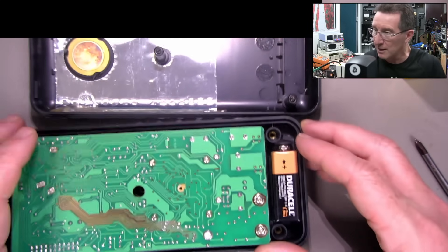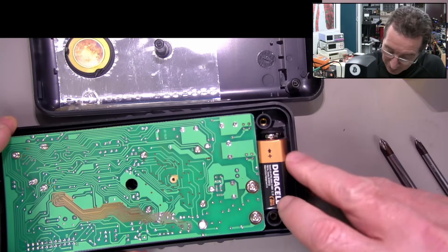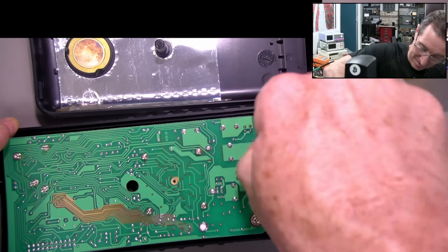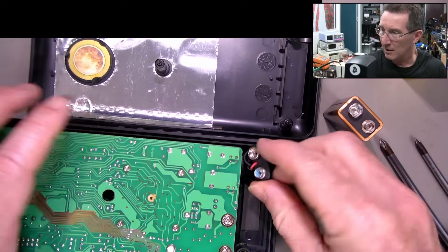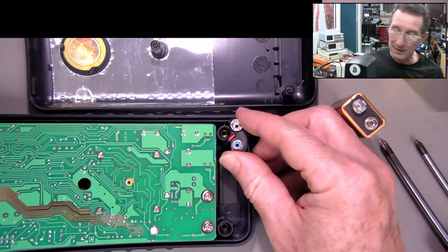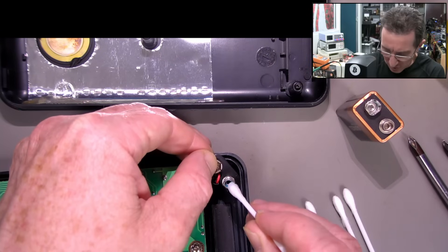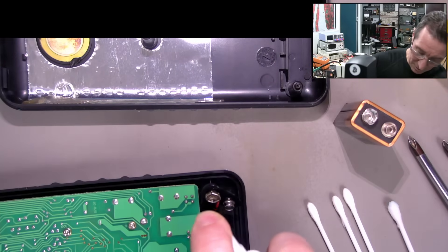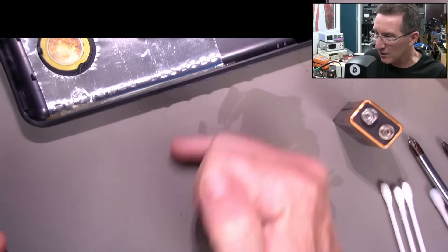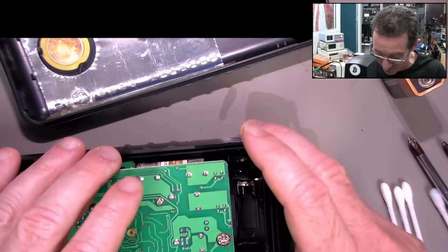I swear, if all these work I'm going to be so embarrassed. It's got a DuraLeak in there but it hasn't leaked - March 2013. There's a bit of corrosion in there - I'll clean that up. I've got the vinegar to neutralize it, then finish with some isopropyl. I should do that over on the dirty bench. Again, let's tighten up the jacks.